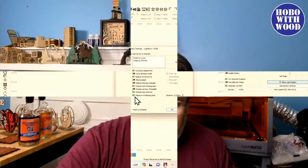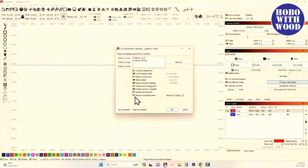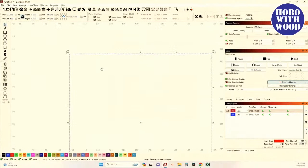But when you add kerf and you butt those up against each other, you can do that in LightBurn. On the screen, you're going to butt them right up against each other. And LightBurn, and this is a shortcoming, I think, in LightBurn's programming. I think LightBurn should be smart enough to not let this happen. But this is what happens if you try to butt your materials up against each other. And this, Stacy, might be what you were having problems with. Maybe if you were butting things up against each other and then you added kerf to it and things were just not fitting right, well, here's why. I'm going to leave that on right now.